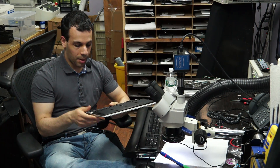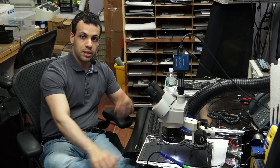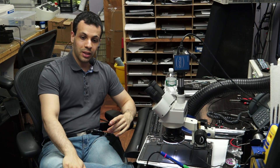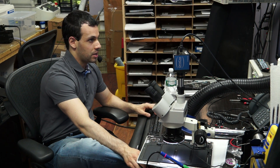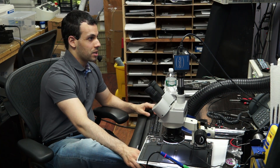One of the things I want to get across here is knowing how to go down the right rabbit hole. I had 0.5 volts on PP_Bus_G3Hot. What a newbie is going to do is look at the schematic, see that's the first voltage listed, and start trying to figure out why PP_Bus_G3Hot doesn't work. They're going to look at what creates it, probably go to U7100, and measure everything in that area. Just look at how much stuff there is to measure. This is going to become a rabbit hole to hell, because that entire circuit works.